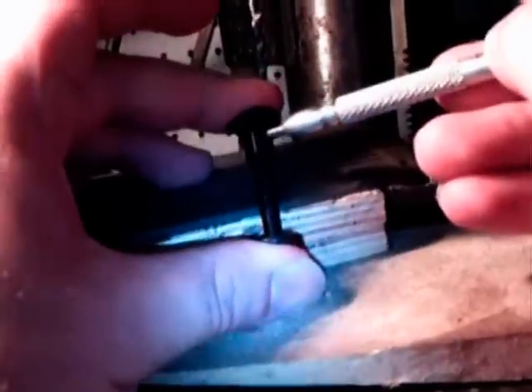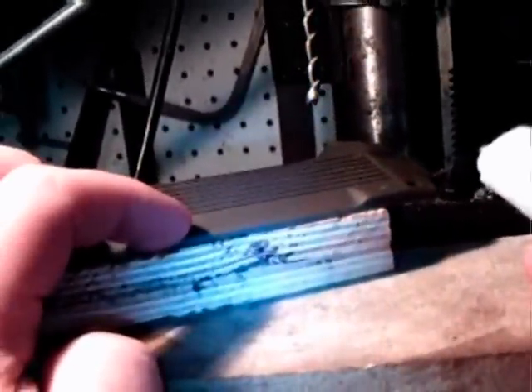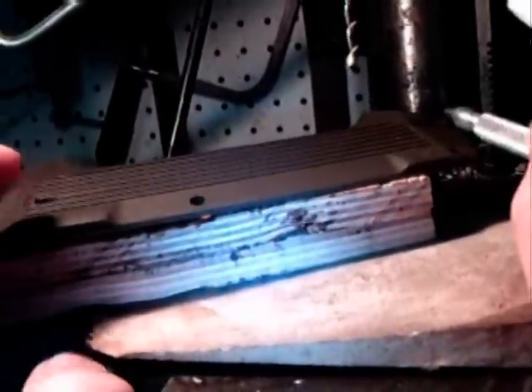These I just picked up — I believe from Aiko, sold as furniture hardware. It's black oxide steel. The portion up here where the nut is is about three-eighths of an inch in diameter; this portion down at the bottom of the bolt is about a quarter inch diameter, which should help you easily determine what size drills you need. I've got a quarter-inch auger bit, I believe from Rockler. I've already got the point on the handguard center-punched — I just pressed in with my carbide scribe until a dent was made. It doesn't need to be too precise on the far side. The barrel on the Norinco Hunter is the same diameter from roughly where the retainer will be all the way back to the receiver, so it's going to be the same height right in the middle of the third complete rib down.